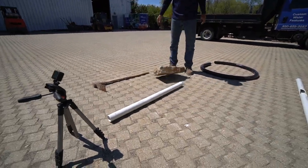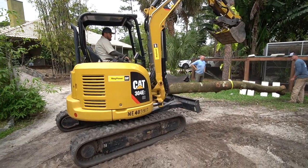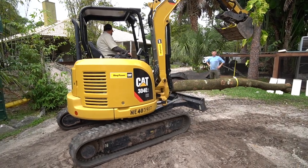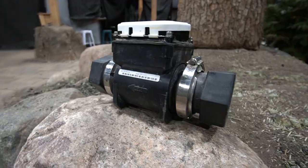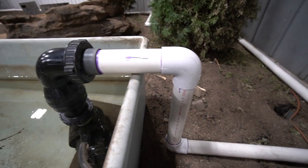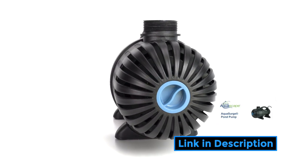It's also about impact. Our construction jobs are brutal — commercial job sites can have vehicles driving back and forth, even in your backyard you could have mowers, people having access. You don't want a rigid pipe system that could potentially crack. The final thing is obviously flow, because having the right diameter of pipe is critical to allow all that water flow through the system. I want to make sure we're getting all the water we're paying for. Those pumps cost money to operate on a daily basis. I want maximum flow out of that pump system so I can have maximum benefit from a water quality standpoint. I like flexibility when I'm designing a water feature because things automatically pop up.